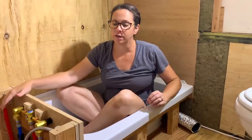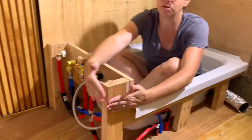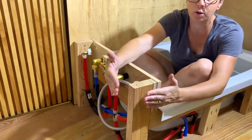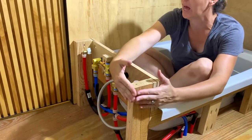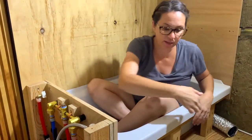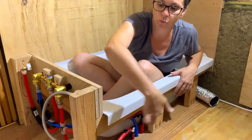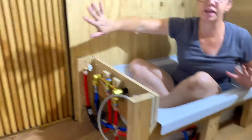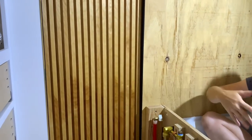And our goal, hopefully our carpentry skills will be good enough, is to miter these two walls together in the corner. Instead of doing a butt joint, we're going to 45 it and have a mitered corner, and hopefully that will look nice. And then the slats will kind of wrap around and just kind of play nicely off of our pocket door design for this.